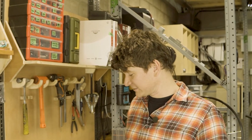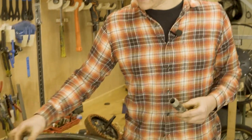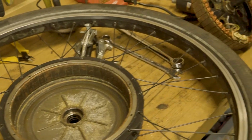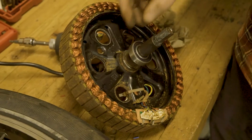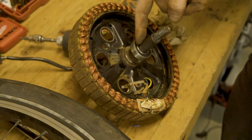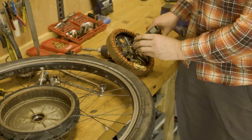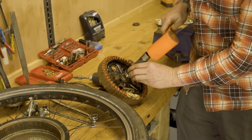It's a bit of a toss-up whether you want to install the ball bearings on the axle or press them into the side plate first and then have the side plate go onto the axle — it really depends which is the tighter fit. You want to pre-install the bearing on whichever surface it fits most snugly. As always when dealing with bearings, push on the inner race if it's going on the axle, or push on the outer race if it's going in the side plate, so you're not stressing the bearing as you tap it in. Just find an appropriate size pipe or tubing and then tap it back on.